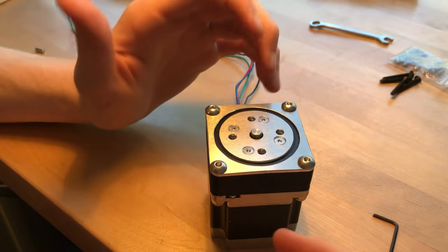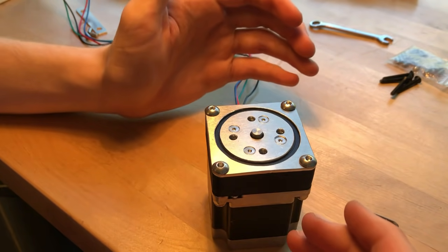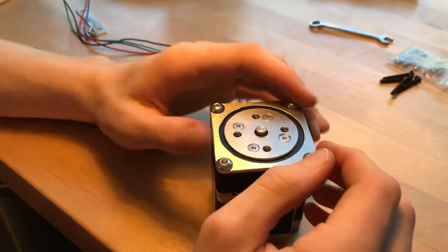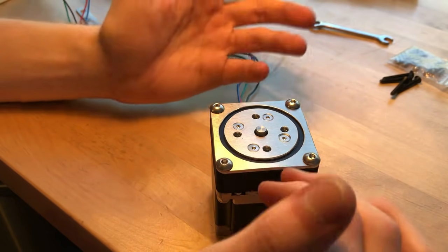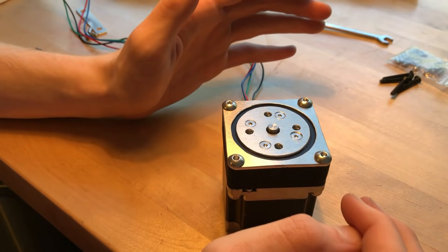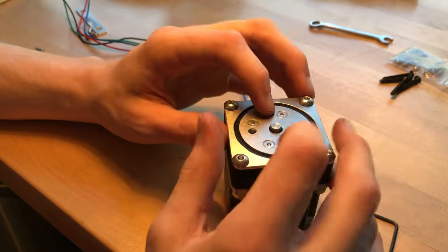The other issue, the big issue, with the non-constant output rotation speed, that is a problem with the output pins. The pins that were coming out of this bearing piece were kind of cockeyed, which I mentioned earlier. I believe that's the reason that it's not totally constant. If those pins were perfectly perpendicular to the plate, then I'm guessing that output rotation would be a lot smoother. Unfortunately, I don't know if there's really an easy way for me to do that. I might need to redesign how this thing goes together.